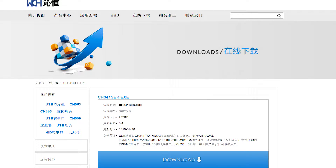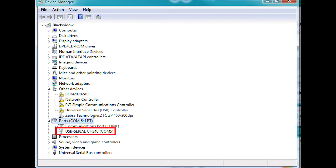If you Google search 'CH340 drivers' and your operating system, you'll find a bunch of download pages. Most of them are in Chinese, so download at your own risk. Once that's all set up, you should be able to connect to the correct COM port within the Arduino program. As you can see here, I think mine's hooked up to COM port 5.